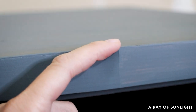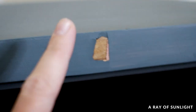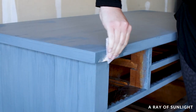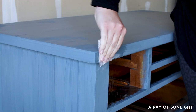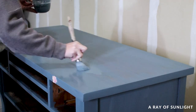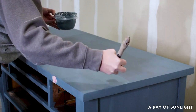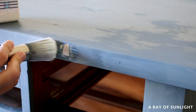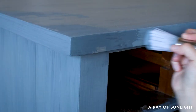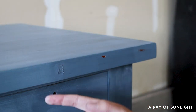When I came back the next day, there were two places where the veneer was lifting, so I chipped those off and filled them with wood filler. I had to touch up those spots where I had wood filled — I put some extra bond over them to help the paint stick, and then I painted over them, just to find that one of them was chipping again.